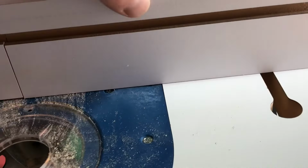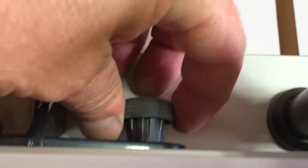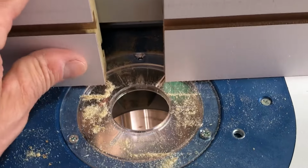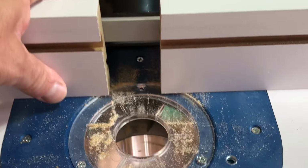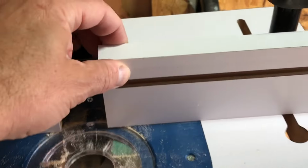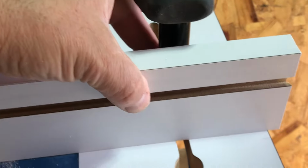And it has a dust collection. Let's see, loosen that and loosen that. And then these will slide. So I loosen up the knobs on the back. And so you can bring this in. You can attach stuff for a zero clearance fence. You can clamp stuff on. You can plug a hose into the back here. That hooks onto the knobs here. Once you have the fence set where you want it, you just lock in that knob.